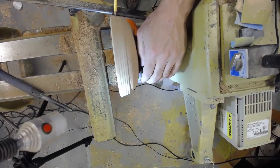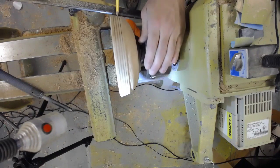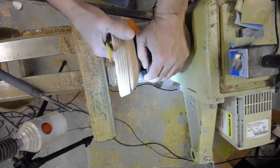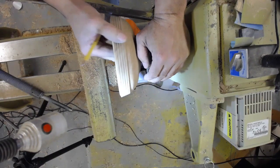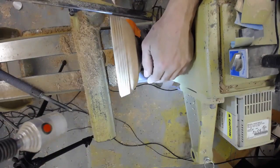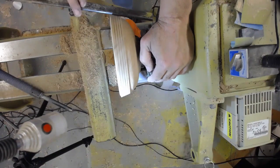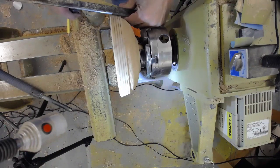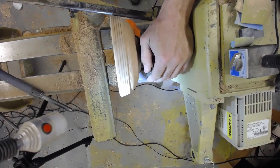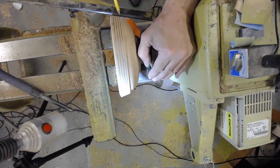I'm already a little out of round — that bowl must have not been completely dry even though it's been sitting in the shop probably for eight or ten years. Even dry wood will have some various tensions — if you take a dry board and split it down the middle it often bows because the two sides have tension in them. And then I need some lines headed straight out from the center. I get my tool rest at exactly center height and just use it to make radial lines — I just make sure I'm not turning it.